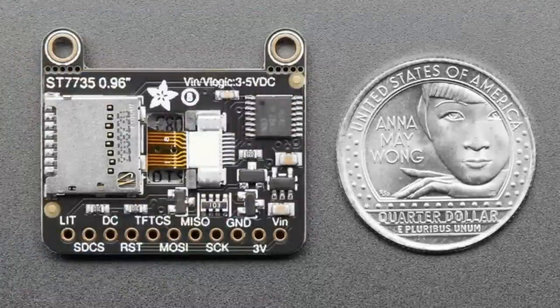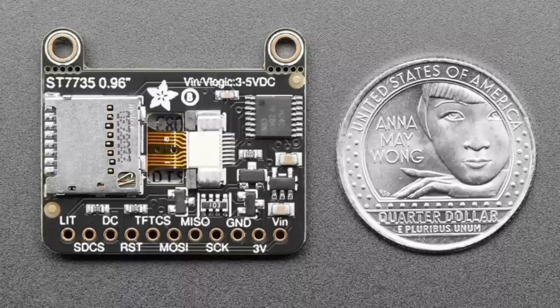And then the other thing is the SD card we're using now, a Molex. It's a very nice micro SD card slot, but it's push-pull, not push-push, because there's not enough space for their standard push-push, which means that you don't push in to pop the SD card out. You just pull it out. Otherwise, it's basically exactly pin compatible, almost exactly code compatible. I'm just glad that we finally got this back in stock.